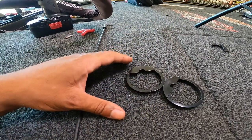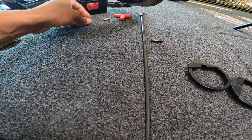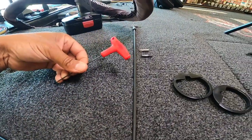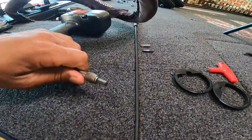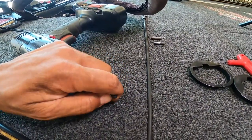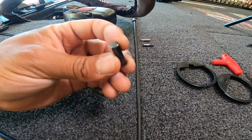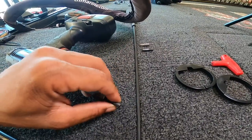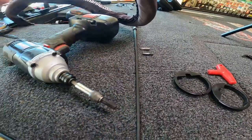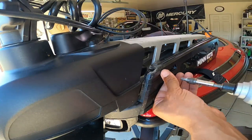You're going to need two replacement bushings, a T30 star bit, a fat screwdriver, a 1/16th allen, and a quarter inch allen. I'm just going to use the drill for that. You can keep blue loctite or red loctite, but I don't think I'm going to loctite these screws back in. We're going to start by taking the side plates off.